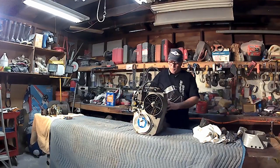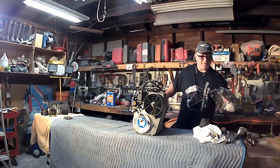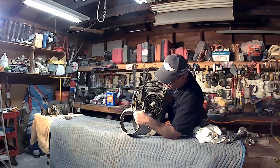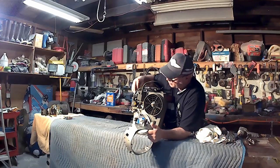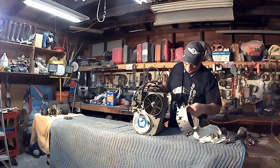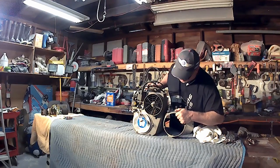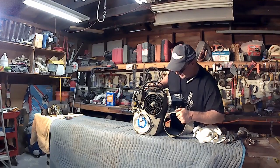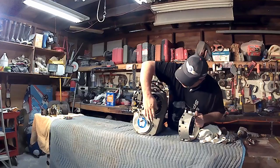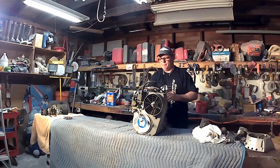So, part of what we have here is this new fan unit that was installed. If you remember, this was an air-cooled engine. It had this back plate on it, and all the electronics that are in here used to sit right here on top. So, I'm curious about one thing here, and that's how much farther out it sticks up. I'm concerned if they're going to have some clearance issues with this guy right here on my firewall. I guess I won't really know that until I get it up to the airplane, but we'll make do.